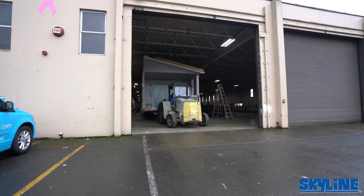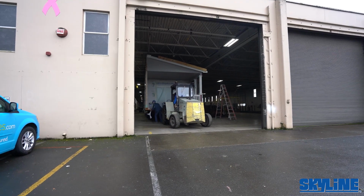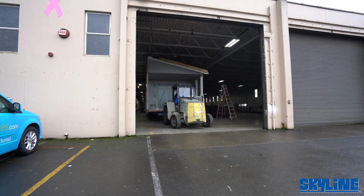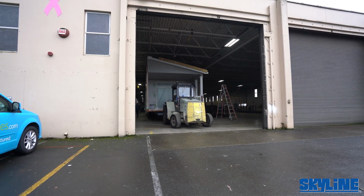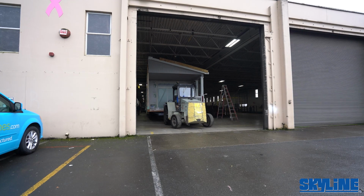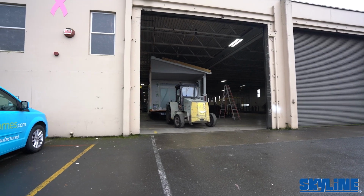This kind of goes back into what I was talking about, where some of these components and upgrades that we have, we just can't complete in station, that tile shower being one of them. So typically the showers go in way back at midline, but because it's a tile shower, you've got specialty pans and walls and all that intricate work. So he'll do what he can incrementally, and essentially this will make its way around out back and get staged, much like we do with our quartz and granite countertops where they've got to work on those outside. It just really bogs the line down.